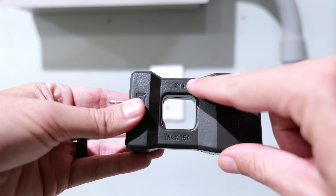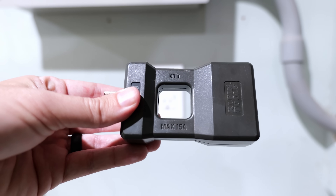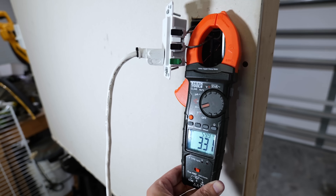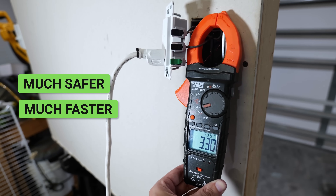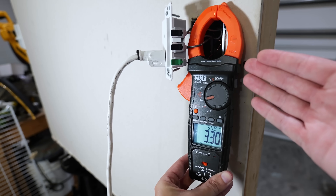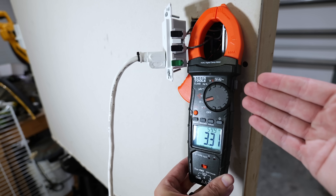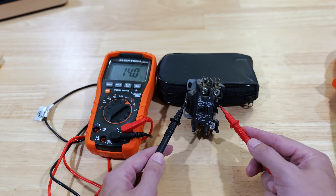The splitter itself shows that the amperage reading will be times 10 and that it has a maximum of 15 amps. These splitters aren't always included in clamp meter kits and can be bought separately — it might be worth doing so depending on what you're wanting to do. With a regular multimeter, measuring amperage this way would be very hard; you'd have to break everything apart to create a test point. The clamp method is much safer, much faster, and an incredibly valuable function. I'll have links for all the different clamp meter models down in the description below.